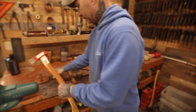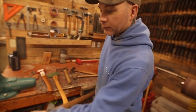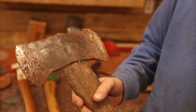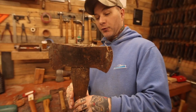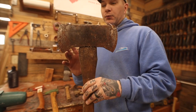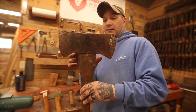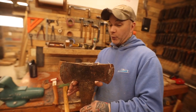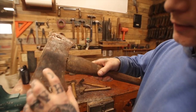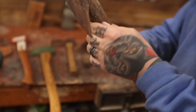So that's some things to look for if you're out trying to buy something cool at an antique show or whatever - those are indicators. And this one here is kind of cool. Whenever I saw it, I got excited at first, and then after doing a little investigation, found some different stuff about it. First off, this shape right here is not real normal - typically this would round down. Depending on this shape, it's really going to dictate what pattern it was - could have been a Michigan or could have been a Western pattern. But this has been modified very heavily. This could be an old head and there might be a stamp under there somewhere. There is a little stamp right there - it's a three. So that might be something good under there.